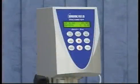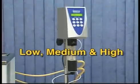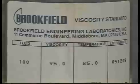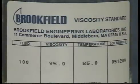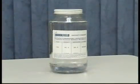The calibration routine checks the linearity of the spring on the instrument by using one fluid at three separate speeds to achieve low, medium, and high torque ranges. This checks the linearity of the spring and the sensing mechanism of the instrument. A 100 or 500 centipoise silicone fluid can be used, as these lower viscosity fluids are easier to work with and to clean.